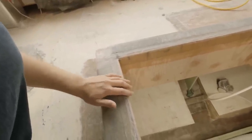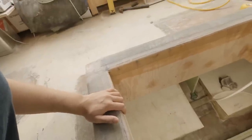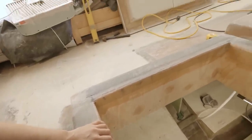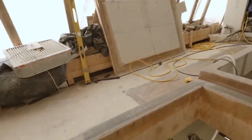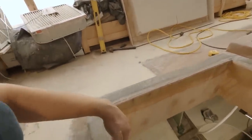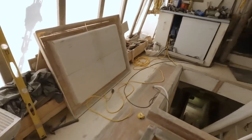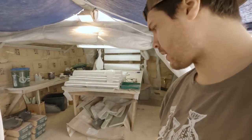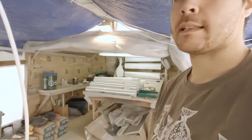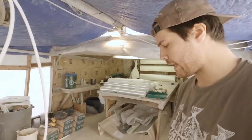The big issue, or the bigger concern, would be the inside, that you don't lay it up too thick. Otherwise, it will be too small. There's no way you can fit it or make it bigger by lifting it, because it's just a straight shot right here. I think what we're aiming for is just the same thickness here. When we glassed that thing together, we took into account that we'll probably be doing a similar layup as all our panels, so about a quarter inch thereabouts of layup.